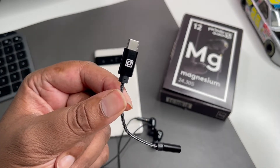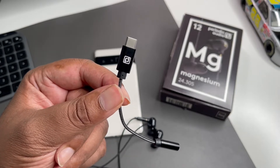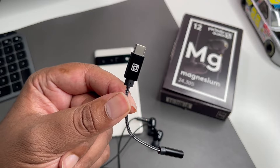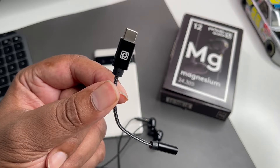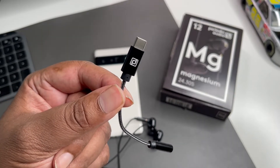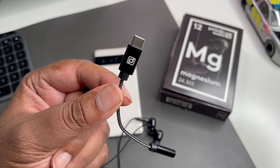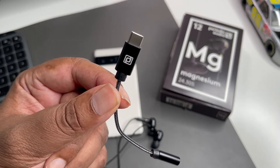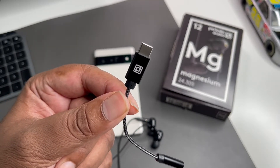RMS is not the max. When you get into speakers and audio, RMS is not the max. A lot of times on cheap audio equipment you'll see max wattage — but RMS is the wattage it can put out constantly, without hitting the max, without blowing. Just a constant amount of power that it can output continuously.